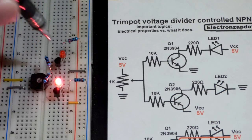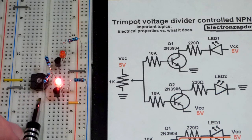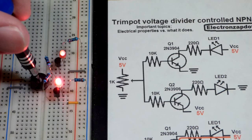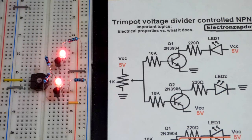There is a problem with this switch — you can see it flicker. I think it's from pushing it into the board and levering it out with the screwdriver multiple times, causing a short. It shouldn't be doing that, but it's not a big enough deal to swap this out for a different trim pot for this video.